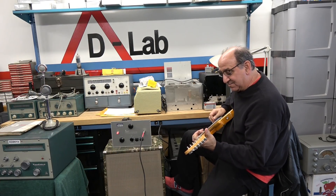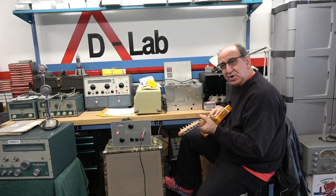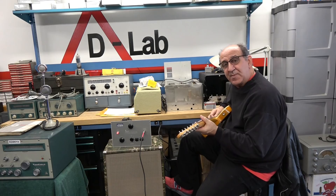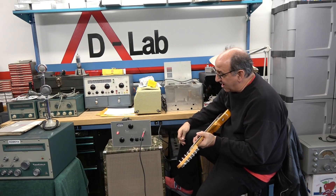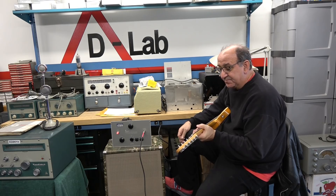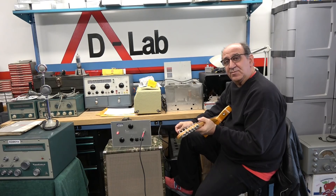I've been playing with this amp for a few minutes here. I'm not really 100% happy with the way it sounds. It sounds a little mid-range scoopy. I've tried to dial the tone controls way back to get a more full range sound. And I also feel like we're lacking in the gain. Terry's going to add another gain section. I've got the amp cranked all the way up — it has a master and a front end volume — and it doesn't really seem to be putting out as much as it should for the voltage on the 6L6. So hopefully the next step will be to address these issues.